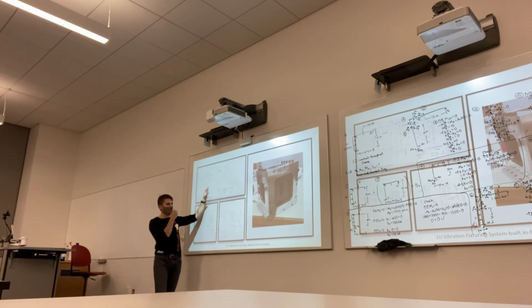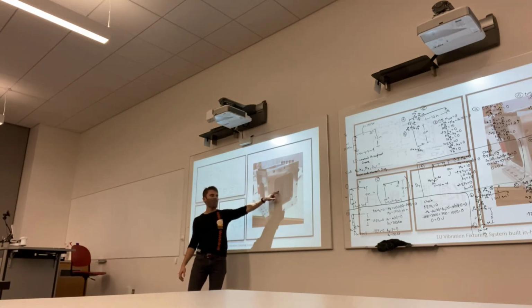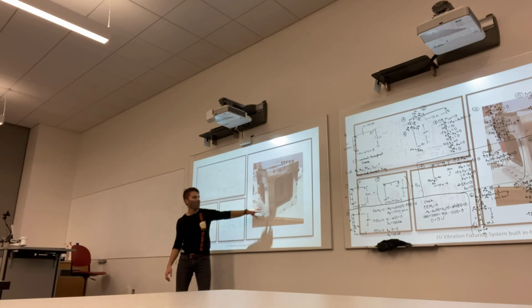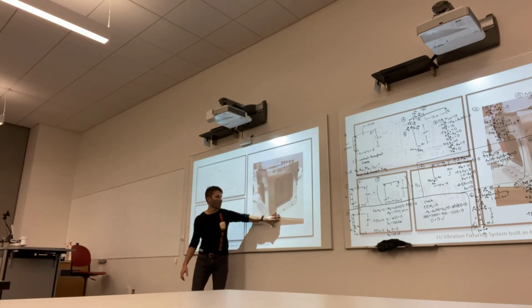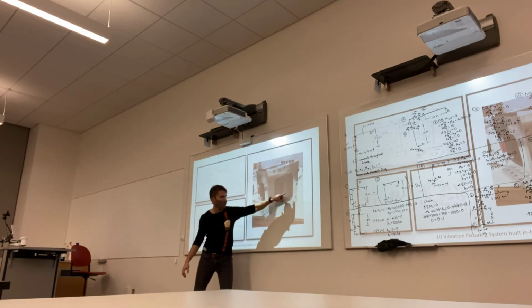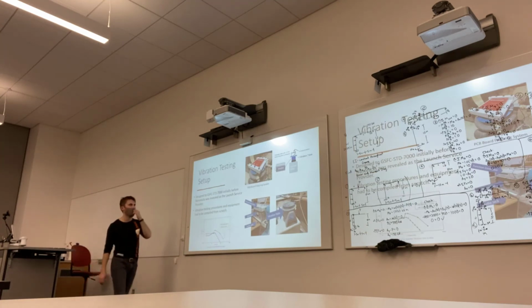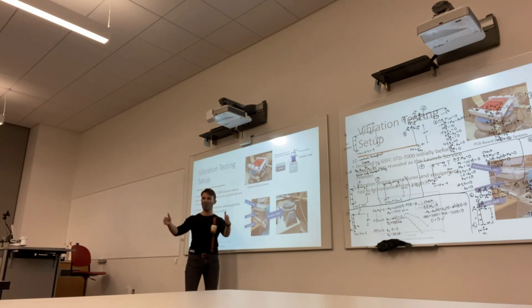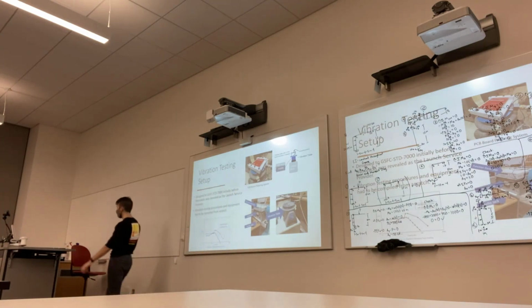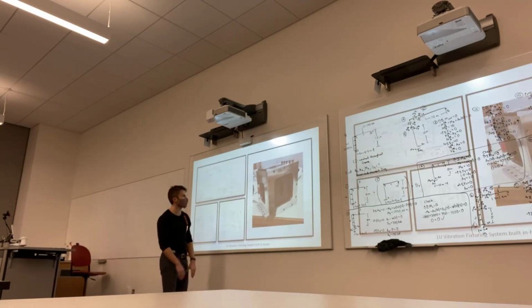But yeah, this is all made out of aluminum. It mounts right here. You can see on the side of it there is the one CubeSat that we have here. Around it is the actual housing that it sits in. So what you would do is you put your CubeSat in and close the plate. There are these 5 bolt hole patterns over here that interface between the fixture and your actual vibration table. It's not pictured here, but the vibration table would have a big board of, say, 20 by 20 rows of holes. Then you take your fixture plate, screw it to that, and that's how you're able to put your satellite on the table and vibration test it.